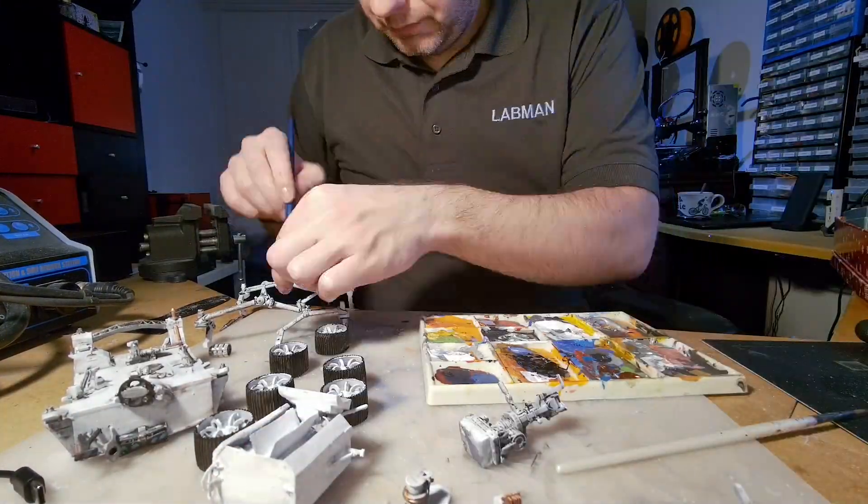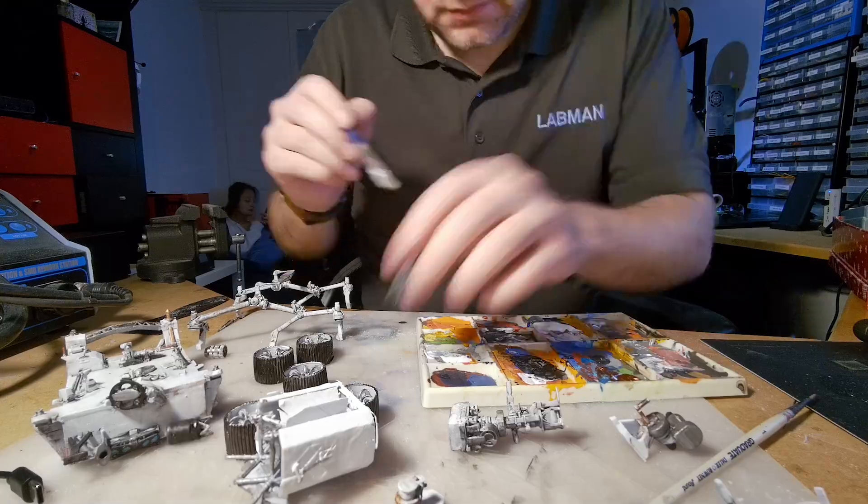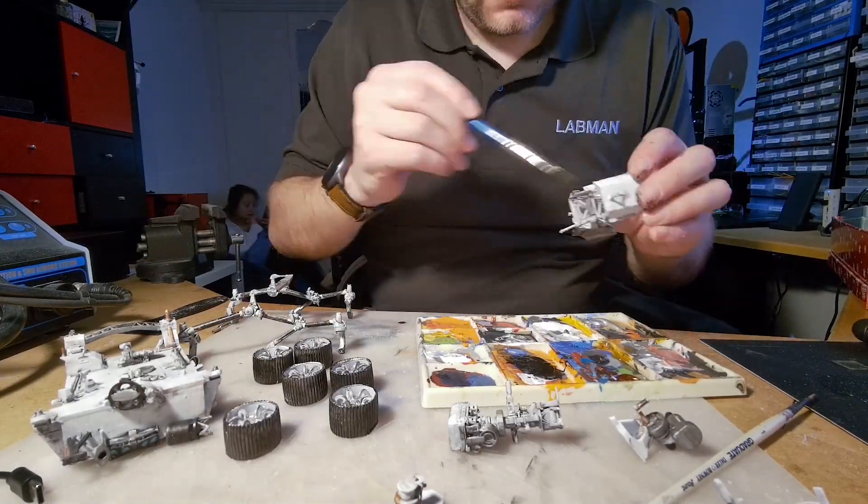It took ages to clean the parts. The best approach I found was to remove most of the supports with clippers, leaving small bits still attached to the print, and then smoothing the surface out with a Dremel, which did a tremendous job at keeping the print intact. Granted, it took forever to get to that stage, but once the model was primed there were barely any signs of damage caused by the supports — so that's the way to go.